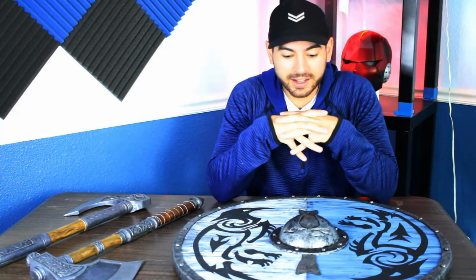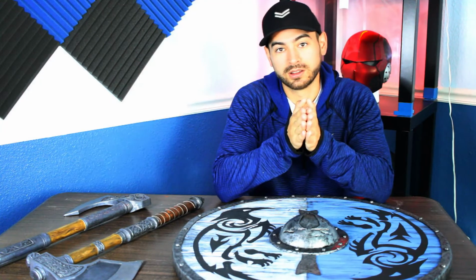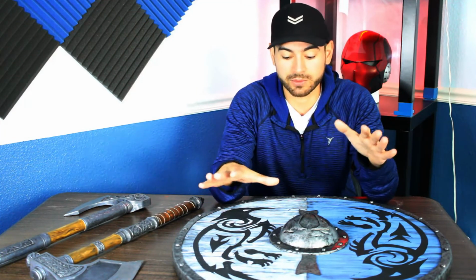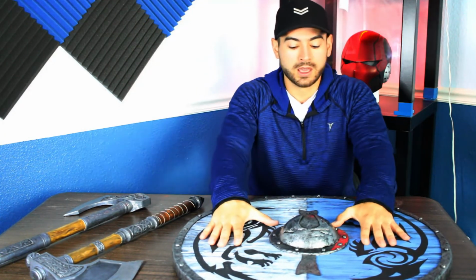So I ended up going with wood glue, and I glued each board together one at a time, and then I glued the 2 supporting back boards on there as well. And then I put a 45-pound weight over the top of them to let them hold and dry for a full 24 hours before I even attempted to touch it, because I really didn't want it to fall apart.